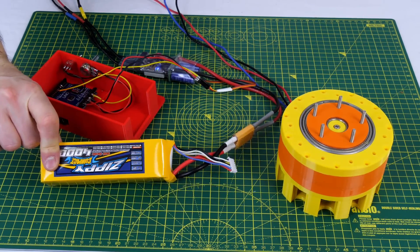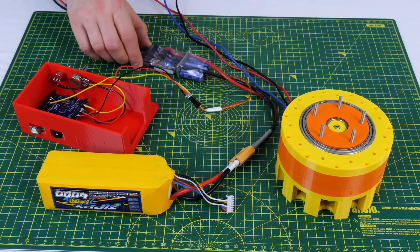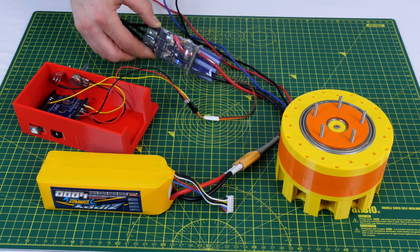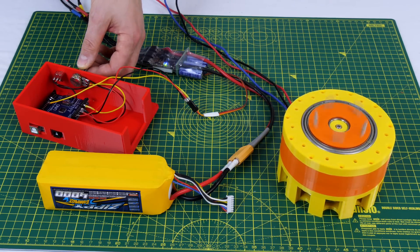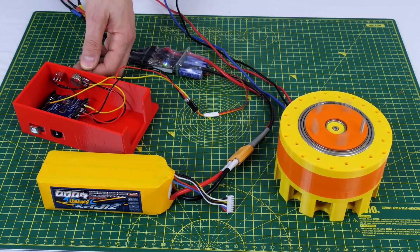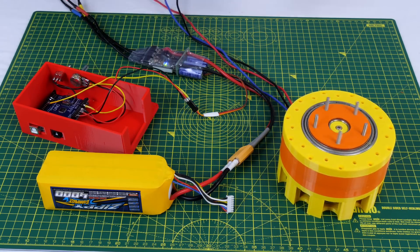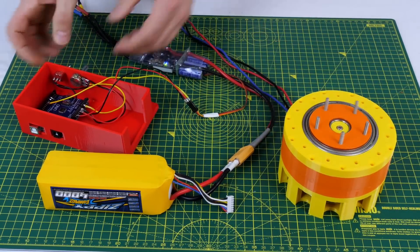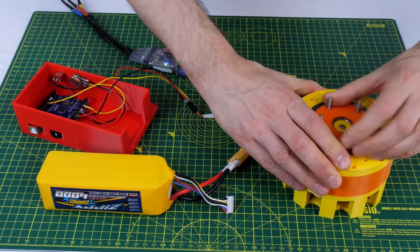As before, I'm using a large LiPo that can source plenty of current, and an Arduino in a box with a knob to provide a servo PWM signal to a VESC. This is really meant for skateboards and only uses back EMF from each coil to work out the motor position of the brushless motor. So it'll run the motor fine but won't be very good at holding a position — not ideal for torque tests — but the motor seems to run fine and I can't stop it with my hands.